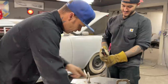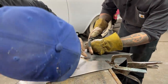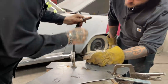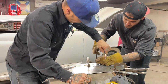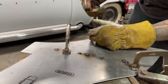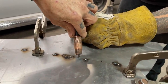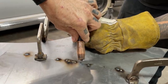So we're going to put the wire where you need it. All right, just a second now. You're kind of close here, so you want to get that welder away from your metal. You want it that far away. You don't want to touch this on the metal. This area does not want to touch, just the wire wants to touch. So grab your welder again. Do not pull the trigger unless we're ready. So we want to put our wire where we're going to weld. There's where you want to weld. Now hold it and just hold it there. Don't move it. Close your eyes. Pull your trigger.